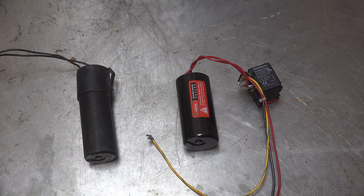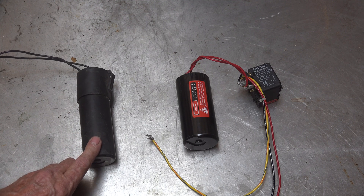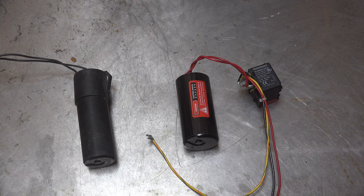This Superboost here — we used to use those a lot, still do — on compressors that were dying. These were a simple hookup, just two wires going to them. So if you came upon a unit where the compressor kicked the breaker or blew the fuses, but it wasn't shorted or anything like that...